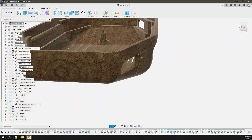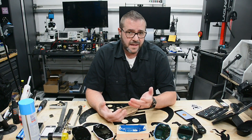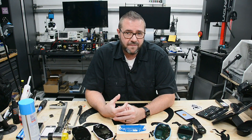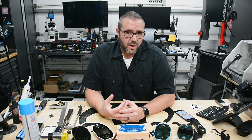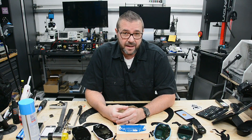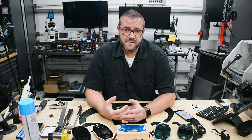This channel is about making production-quality prototypes. You could start with a solid body and remove material until it fits — I've done that a couple of times — but with parametric modeling I find that you drive the internal design to a level of complexity that's difficult to manage. Reworking or changing the design becomes a nightmare. I call it design lock-in: you're so customized into a specific design that it becomes immutable.